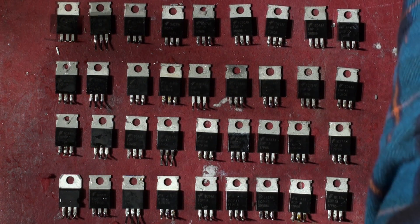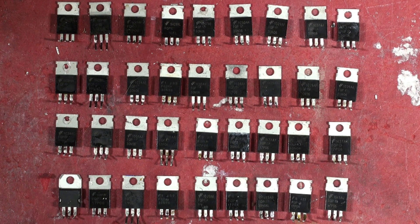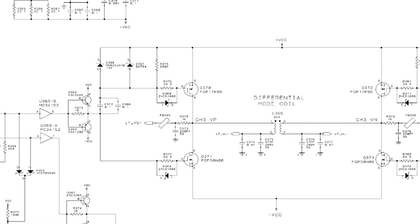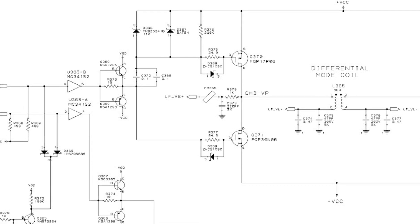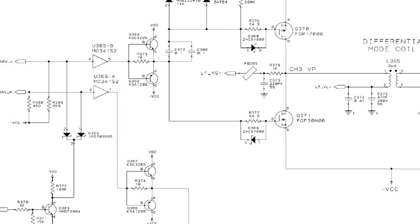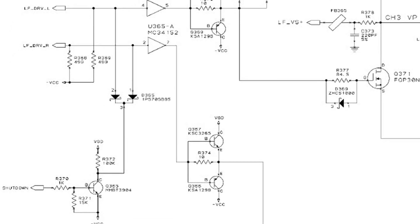On the end of this cable is a GW Instek 1kW clean power supply, and I can cycle the power up and down. You can put programs through to start at whatever phase angle you like, ramp up, ramp down, switch off, brownouts, and everything else. I've set up a brownout which can destroy the output transistors. They are destroyed — you might think maybe they just get tired or overdriven — but they invariably are working when you switch them off, and then you turn them back on and they're not working. It's a mains dip that's causing it.